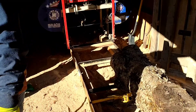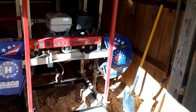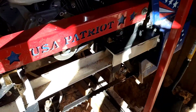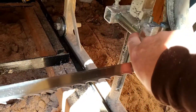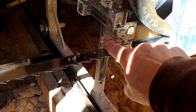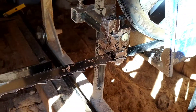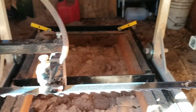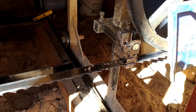We've been having problems with Tim's saw cutting wavy — it's cutting like this. We've watched every video on YouTube about how to stop that; we've done everything we can, we've checked everything. The first thing we found was this bar right here with the guide on it. Tim had a log come loose when he first started sawing and it bent this, so the backer bearing right here was probably three-quarters of an inch away from the blade, which I didn't realize. Tim didn't think it would hurt anything. He tried to straighten it out the best he could, but unfortunately it wasn't good enough.